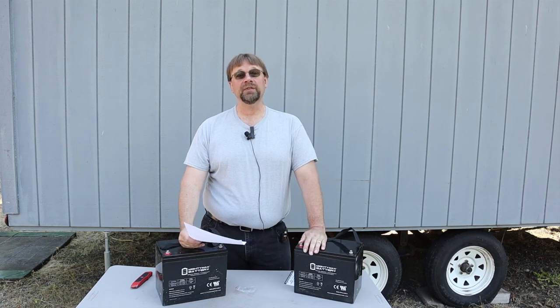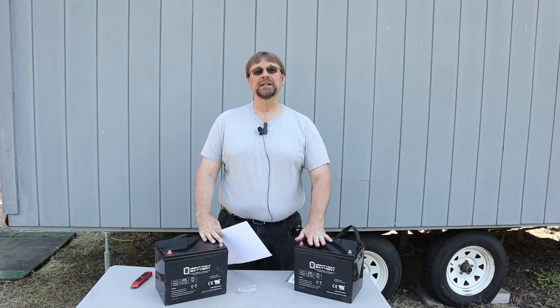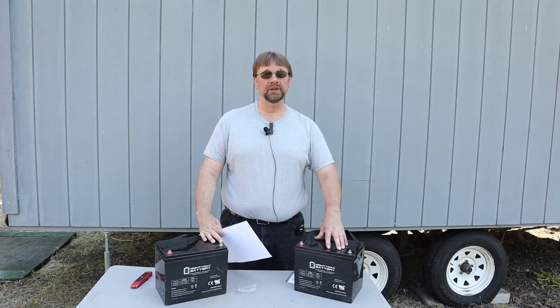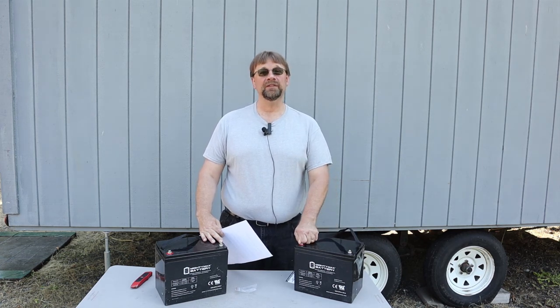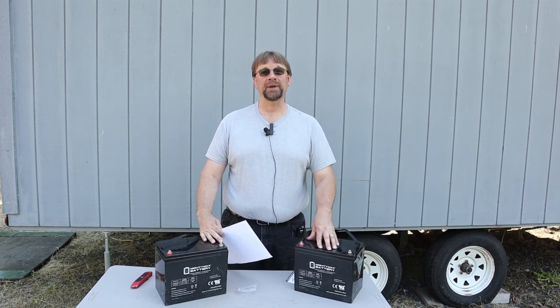I think that covers everything I wanted to talk about in this video. I will be doing a full test video of this battery to make sure that it lives up to its amps. Each one is 60 amps. One thing to remember with an AGM or any lead acid battery, never go below 50% or you will damage the battery. So we will just put it at 50%, use that much power, and then reuse it to make sure that the power hasn't dropped off.